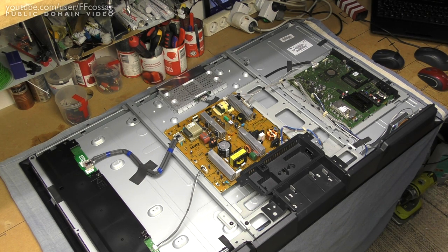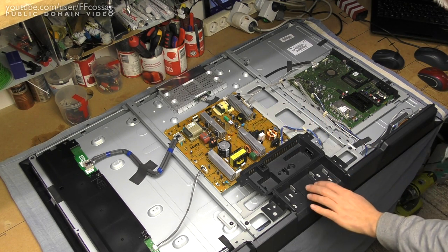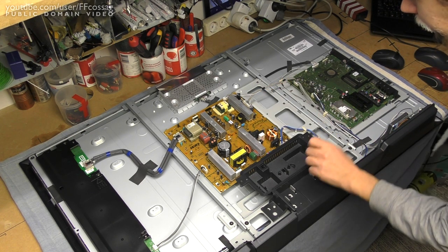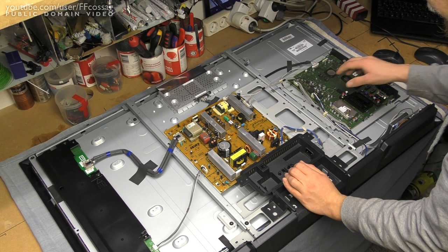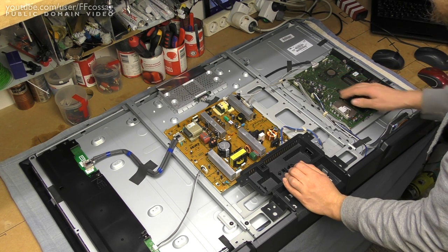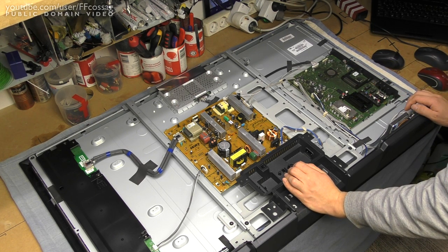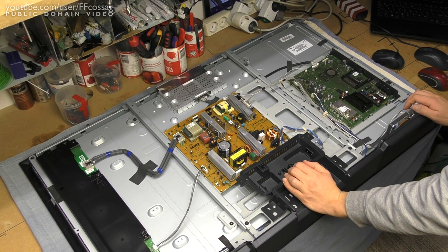We're inside, and this is so typical Sony construction for the time. They have super high quality in the power supply - Sony's don't have bad caps. This one seems to be mostly Rubycon. As far as the caps go, they're going to be fine forever. The same is usually true for the main board. We have an unheatsunk BGA there, which with enough thermal cycles is going to cause you some grief.